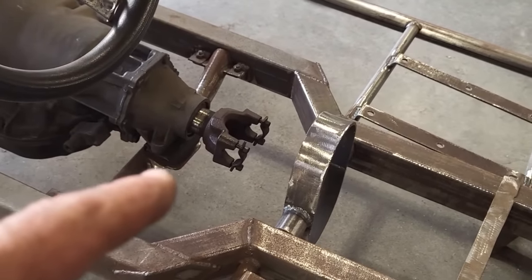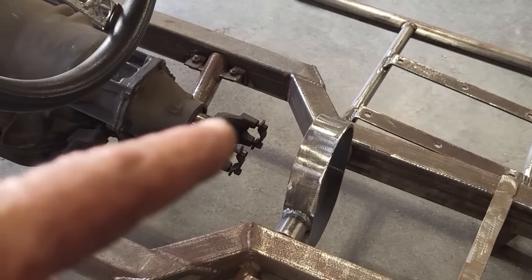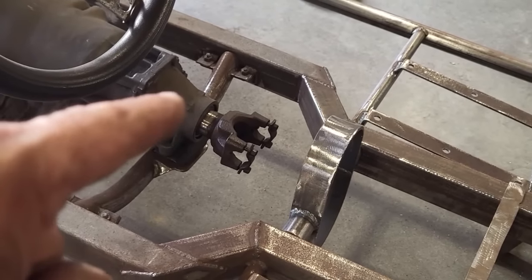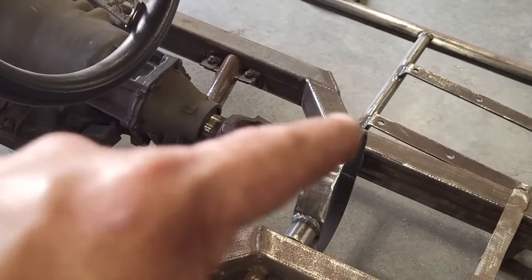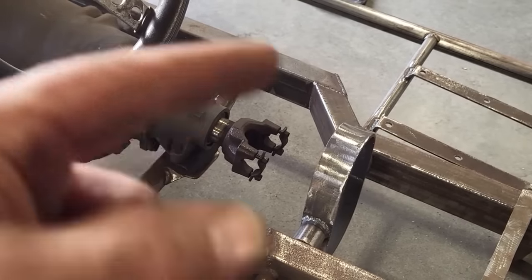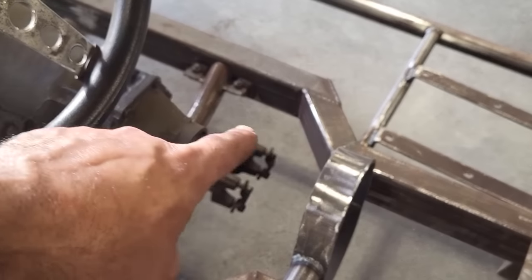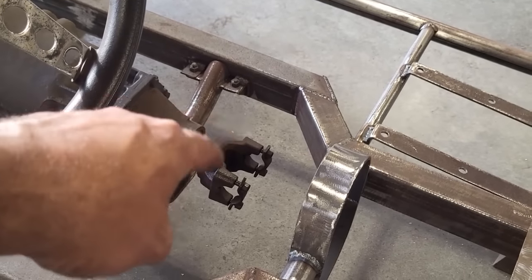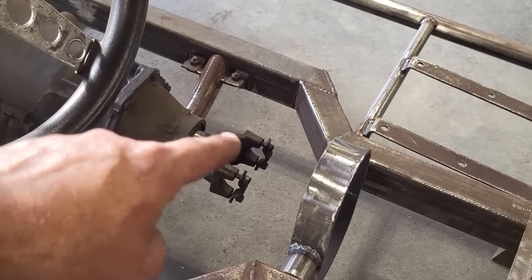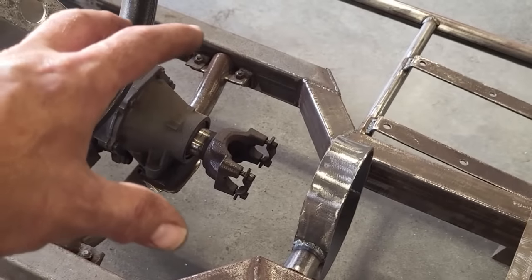In the Chevy 2 that I built, we did the same process as what I'm doing here. And he had the front yoke explode and the back of the transmission come off it, okay? And the shifter setup that I had put in it saved everything. Nothing came up to the floor, but it came up. Because this shifter plate that I'm going to put in here now comes up to about right here, so it covers this whole section here. And then I run two little gussets down from either side here. Some may think it's a bit overkill.